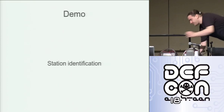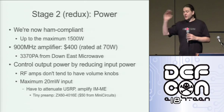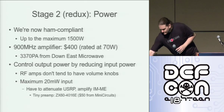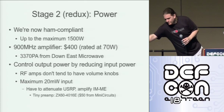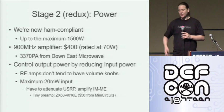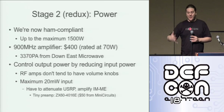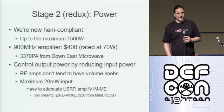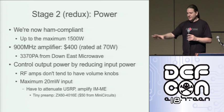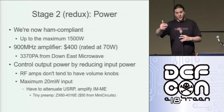So we've taken care of identification and we can now look at scaling up the power level. We're ham compliant — we've got an upper ceiling of 1.5 kilowatts. This is the power amplifier I'm currently using. This big box here is actually the power supply for it. This thing is rated at 70 watts, but if you really crank it up it'll probably deliver a hundred before it blows up. Cost me about 400 bucks — not a tremendously expensive piece of equipment for the power you get. One thing about RF amplifiers: they don't tend to have volume knobs. You control how much power you get out of it by restricting how much you put into it. I've got all kinds of attenuators here and I just adjust the attenuation before the power amp to control how much comes out.